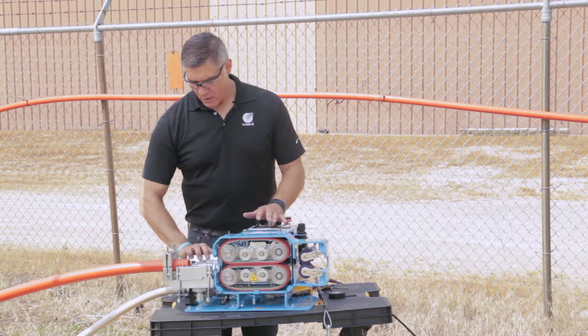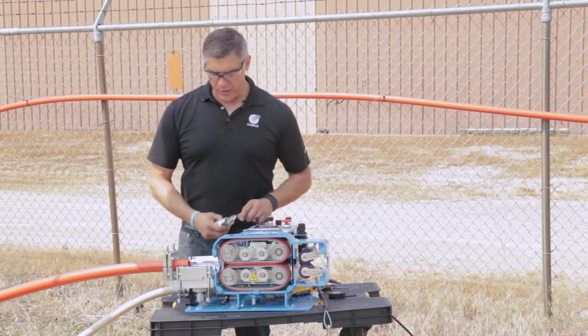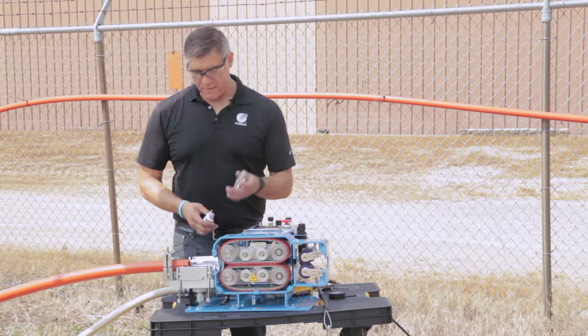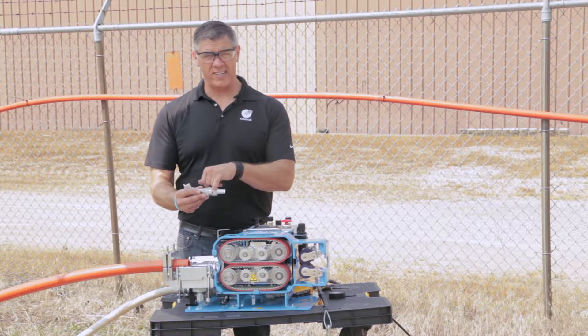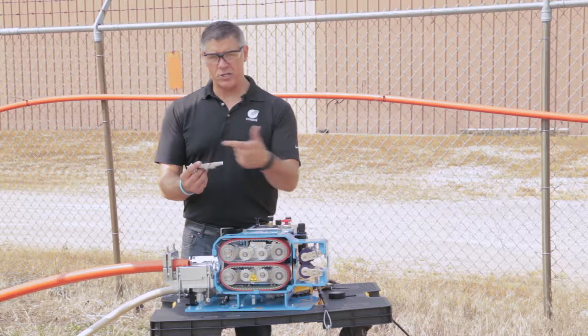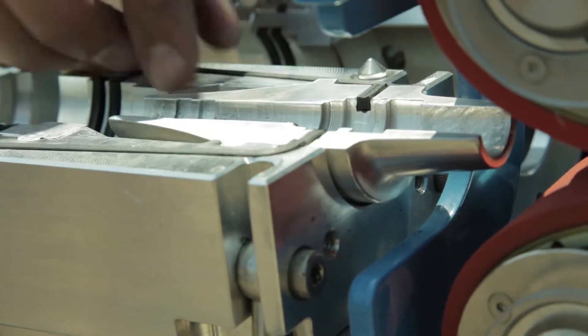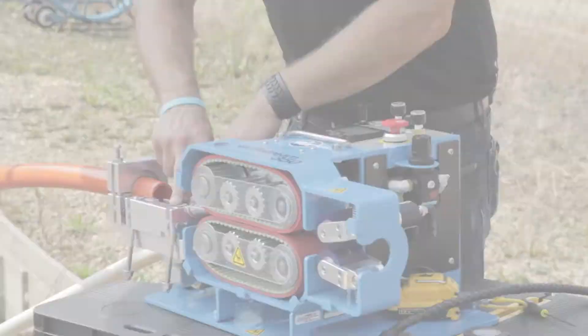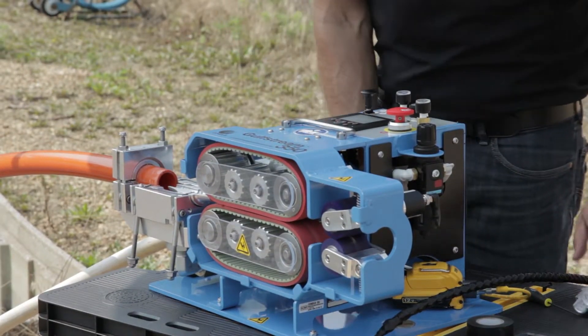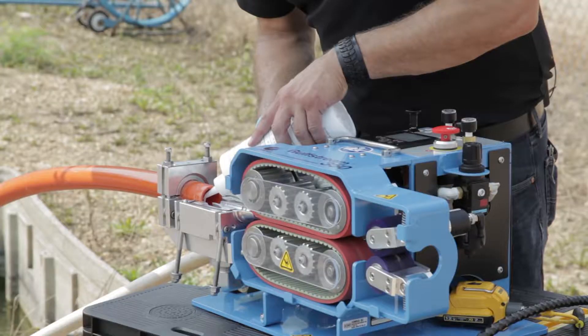Once the fiber is ready to go, we want to get the machine set up. We've already got our duct in our duct clamp. Now we install our venturis — the venturis provide a spot to put our cable seals, which keep the air from going out the back of the air block and force it to go down the duct. It also allows for a straight shot for the fiber to go through, like a guide into the duct. With the bottom of the venturi in place, we're going to add lube — remember: a third, a third, a third — so we add a third of the lube in front of the birdie.